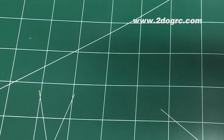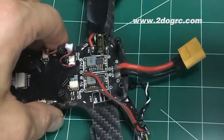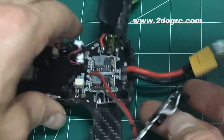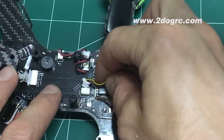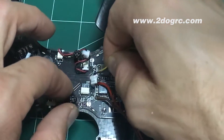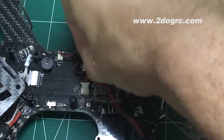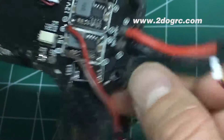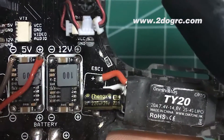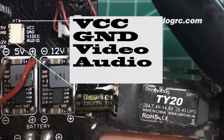Here's the Tyrant 180 — this is kind of my test ship, so I've got it apart. This was also used to make the video on how to plug in controllable lights. On this ship, your video transmitter is coming off of this port right here. It's sitting right here — same wire — and you pull it off. On this one you can see it's labeled: VCC, which means battery voltage — whatever your battery is, that's what it's going to be — then Ground, Video, and Audio.